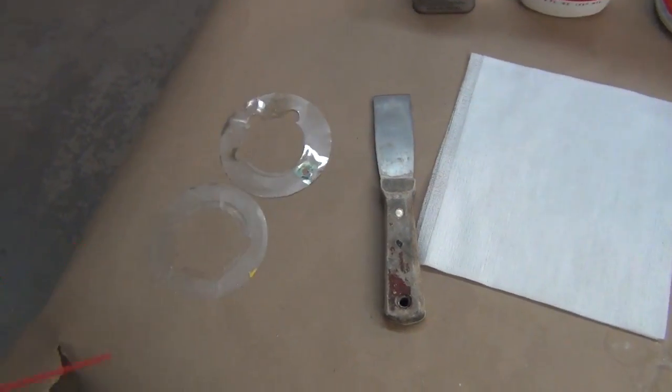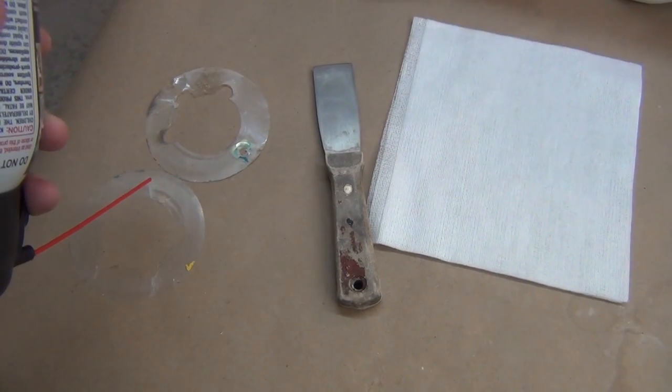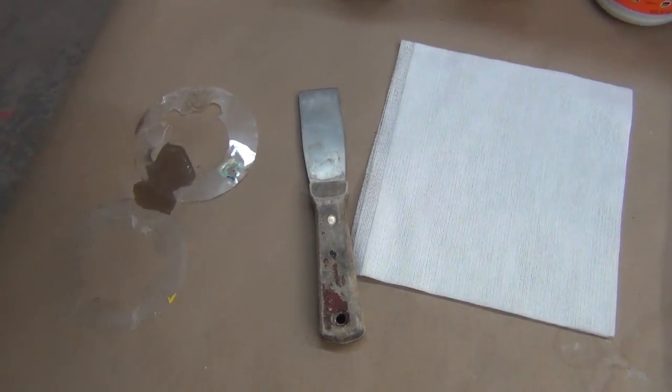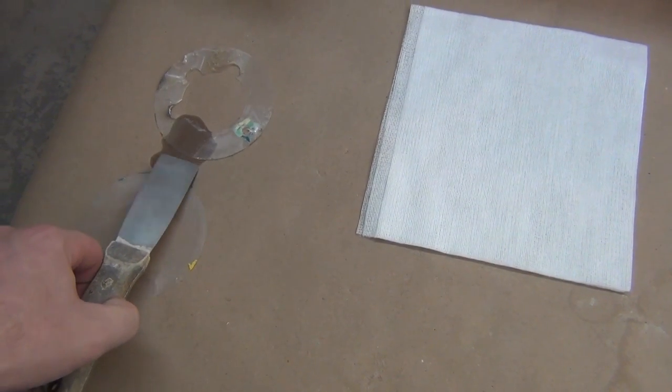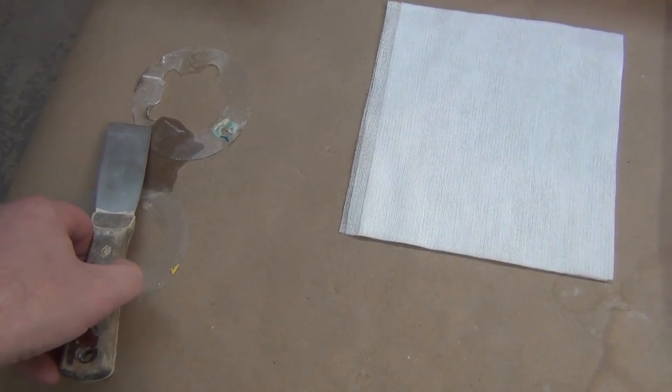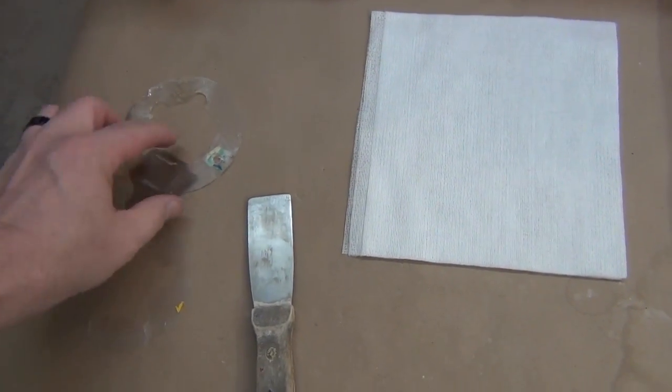And anyone who does this already knows, but still, it's got glue, they're glued down, and you give it a little blast of cold air like that, and as soon as you do, that glue will release, and you just get a little putty knife under there, just slowly keep putting that cold spray down, and it'll just peel right up.